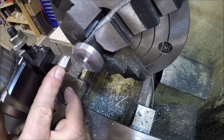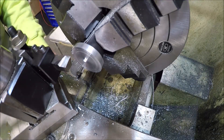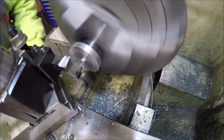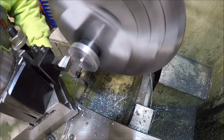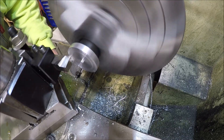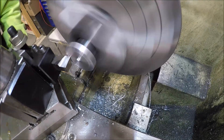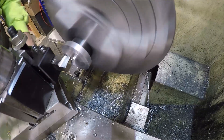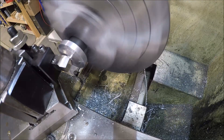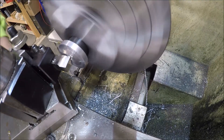I've got it indicated in with a piece of flashing to protect it so the jaws don't gall into the arbor. I ground up a piece of high-speed steel — figured we'd try to go a little old school and see how the surface finish looks. I had to move the camera because the compound's lock-down handle was in the way. We'll see if I got this on center height — I'm off a smidgen maybe.